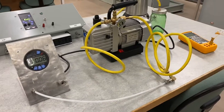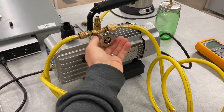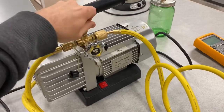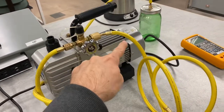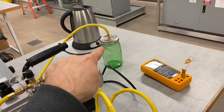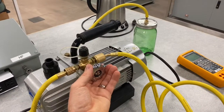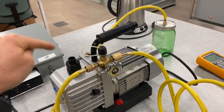I'm going to turn the pump on. First I'll shut the valve and put this cap on here. When I turn the pump on, this is the suction side, so it's going to suck on our gauge and also on the jar over here, pulling as much air out of the jar as possible. This end is capped off so we don't have air coming in, and when I open the valve it's going to start sucking on these two lines and discharging the air out through the pump.